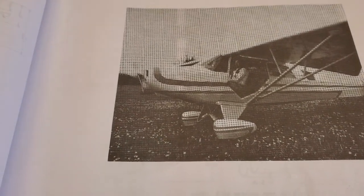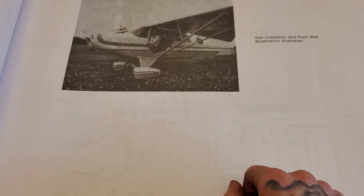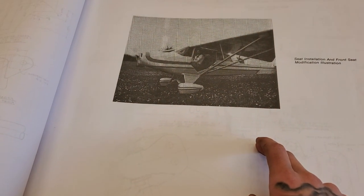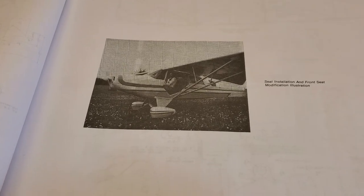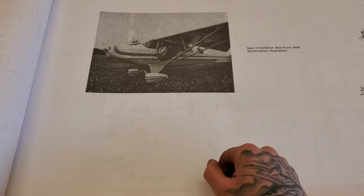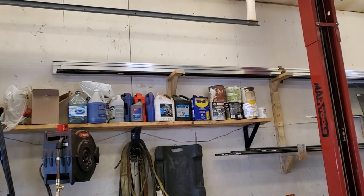I'm going to build a combination of a PA-14 and a PA-18 wing, so I'll be using the metal wing. WAG does sell an extra set of plans for a metal wing and a material kit that comes with spars, ribs, and all that. I'm going to do longer flaps than the STC-14 — not quite sure of the exact measurements but around 50-50 for flaps and ailerons. The spars are going to stay the full 17 feet and they'll be squared off on the wingtips.